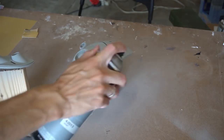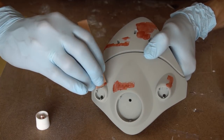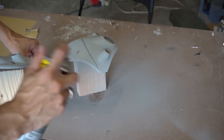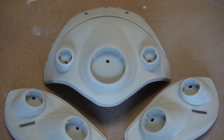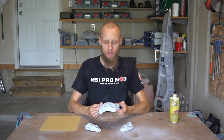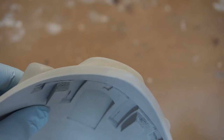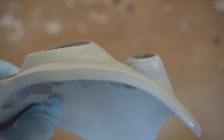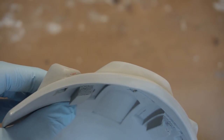After wet sanding and drying, the piece is again covered with spray filler. These three steps — applying spot putty, wet sanding, and adding spray filler — can be repeated as often as you are satisfied with the smoothness of the surface. I did this entire cycle two times to really get rid of any scratches or smaller holes. If you remember how the bottom edge of the front panel looked at the beginning, you will see that all gaps and bumps are gone now and we have a perfectly smooth and even surface.